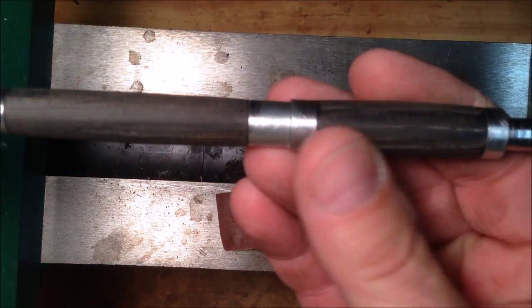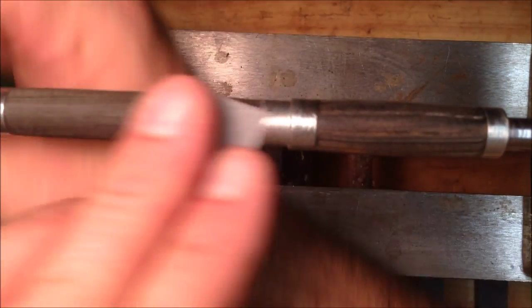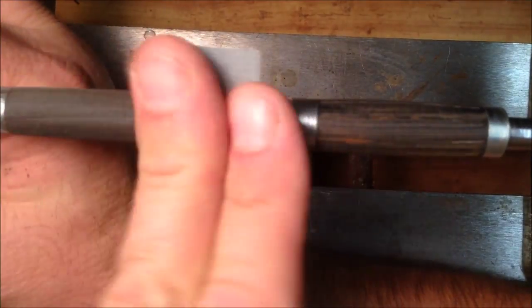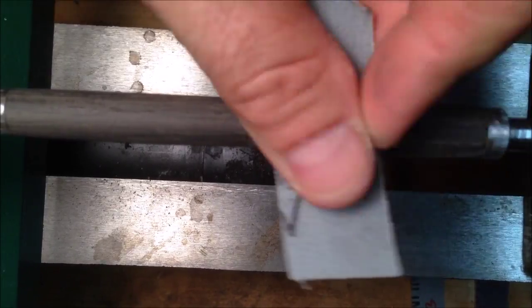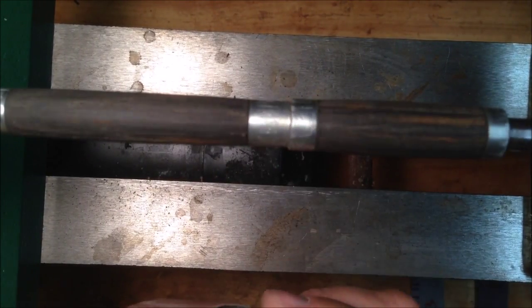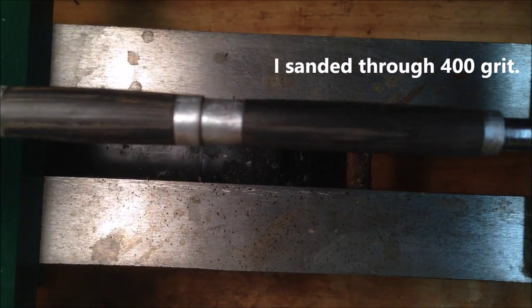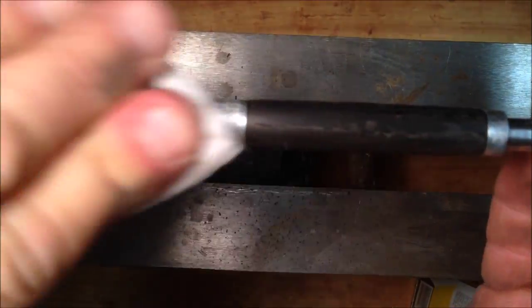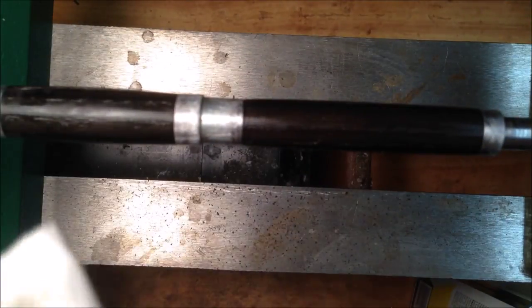This blank really feels rough with all those crevices in it, but it looks pretty good. Let's sand long ways here to take out any of the deeper scratches. You want to make sure you don't rub super hard to where you tear the blank up, but hard enough to remove the deeper scratches — because the lighter papers just won't do that. Alright, that looks pretty good. Let's flip it around and get the 200 grit out. I'm going to get some denatured alcohol and clean this blank up really well, because the cracks and crevices are really packed full of dust — I want to get as much of that out as possible.